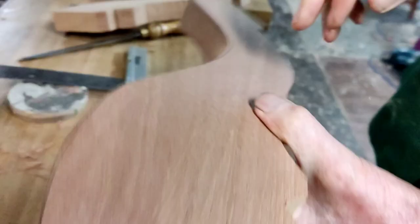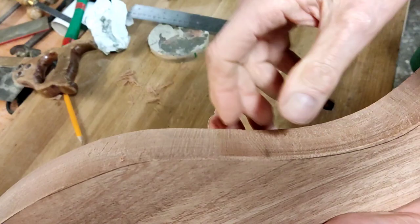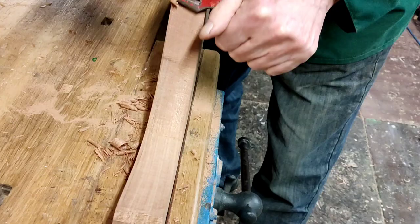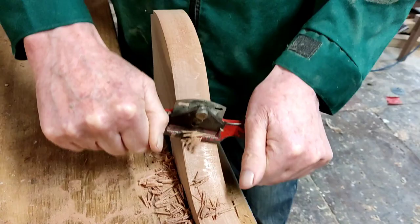So if I bring that down to the line — oh, you're putting a wee chamfer down to the line? No, that'll tell me where I'm going to. Ah, you know where you're going then. Instead of just trying to go down to the line and working away all the time. So you put a wee chamfer on that? Yeah, but the grain going on that is going very weird there — it's coming down there and then it's changing. I have to put it on slightly. I'll hold it at an angle. Maybe you get a chatter when you grab it. If it's cutting well, I hear that sort of sharp grind. I'm slowly bringing it down, but I'm watching to not rub the grain.